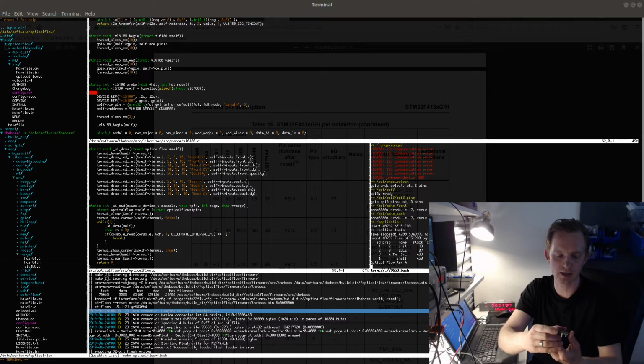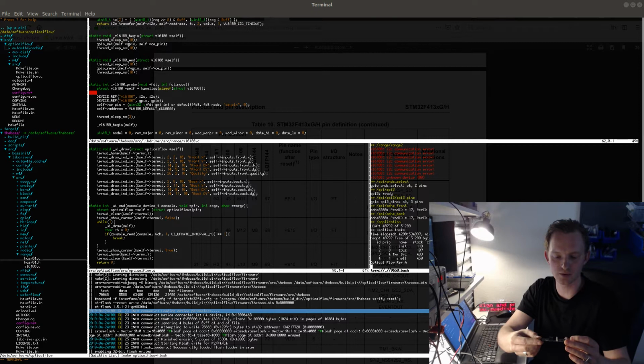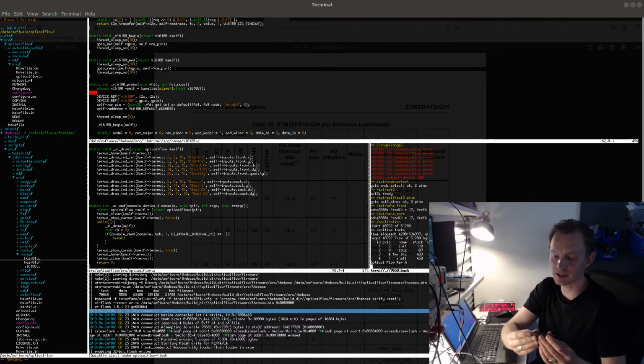In order to get them working, I think it's actually good that I had the voltage conversion, even though I ended up not using the voltage conversion from 3.3 volts to 2.8 volts, because the sensors are 2.8 volts, and the rest of the board is driven by 3.3 volts. But the sensors are actually specified up to 3.6 volts. The datasheet says that the power supply should be 2.8 volts for the sensors. But it seems to work fine, that they actually interact with the 3.3 volts I2C bus.